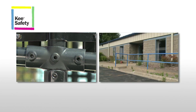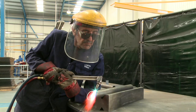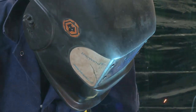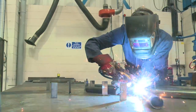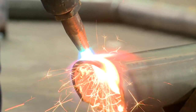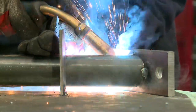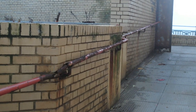There are two principle methods used for installing guard railing: fittings and fabrication. Fabrication takes a lot of preparation, as sections have to be fabricated off-site before installation, and detailed plans of individual sections require drafting. Prefabricated sections are delivered to the site, where a skilled installer needs to assemble all the sections according to the plans. There are many health and safety implications associated with on-site welding. Cutting holes breaches the metal's anti-corrosion coatings, which are then further compromised by welding. Corrosion properties can be restored by painting the fabricated rails, but this has to be meticulously maintained to ensure lasting protection.